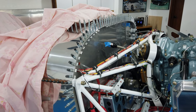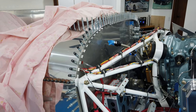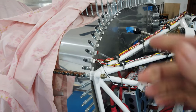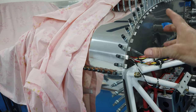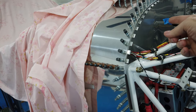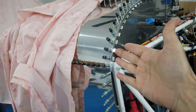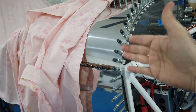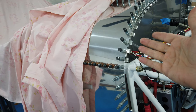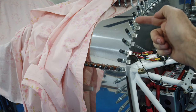The top hinge is completely finished. This is the other side that I had been working on — it's a lot easier because it's so short, not as much drilling and countersinking. I did it the same way as the other side: I did the shim first, dimpled it, and then started to fit the hinge.